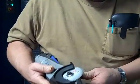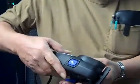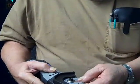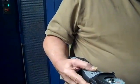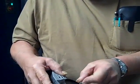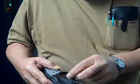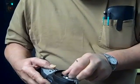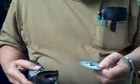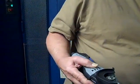And then I can show you how easily the blade is changed. You've got the little blue button on the top right here. It locks the mechanism so it can't turn. And just merely take, and by the way, this is a left-handed screw, so you have to turn it clockwise in order to remove the screw. You just take that and screw it out like that. There's a little washer on top of it that keeps it centered.